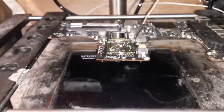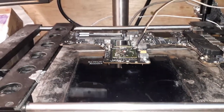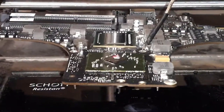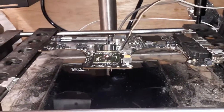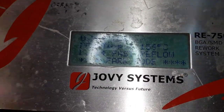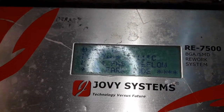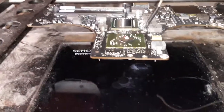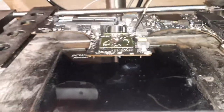The chip is getting hot. There's no sign of boiling with the flux underneath yet. I put the tin on top just so we can see it melting. Let's wait - it's going to take about one to two minutes for it to start boiling. The temperature readings are all over the place - 254, 165, 262, 76, 154. Anyway, let's check out the chip. I can see on one side it's starting to boil - very soon the front side will start boiling as well.